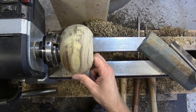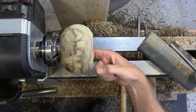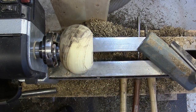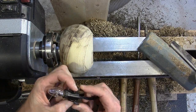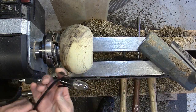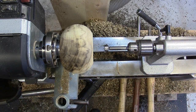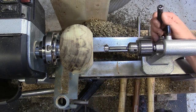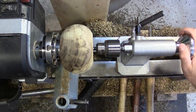Anyway, I have it all hollowed out. The reason I didn't hollow it all the way out is I just don't need it. I need right in this lip here. And I'm just going to drill a hole straight through the center of it now. I just want it so that this slides up in there and locks in, just like it would if it was a metal piece. So this is going to come in the bottom, slide up there and lock in. Okay, the diameter is 3/4 on that little clip, but it won't go around the light bulb, so I had to oversize it a little bit, and I'll play with it to get it to fit tight in there. But I think the little clip should expand enough.